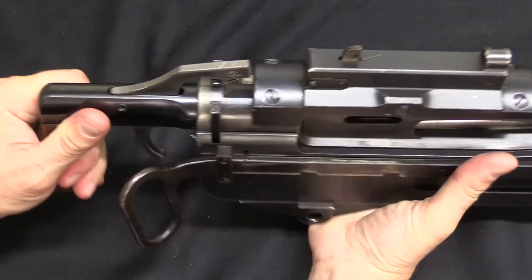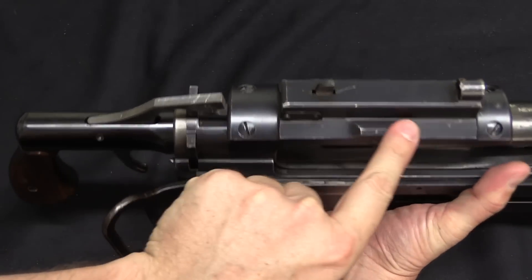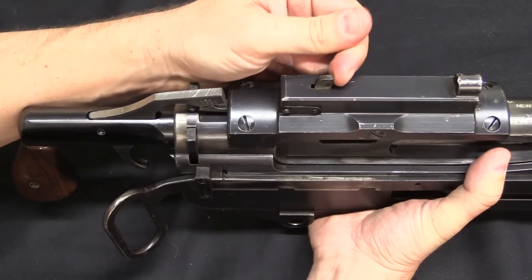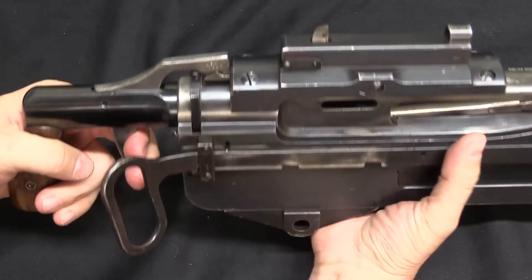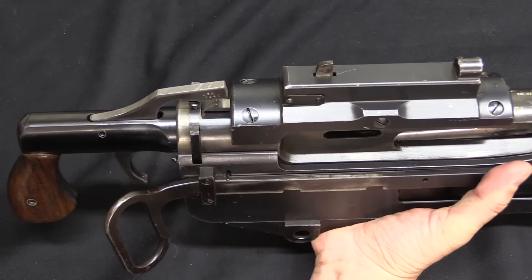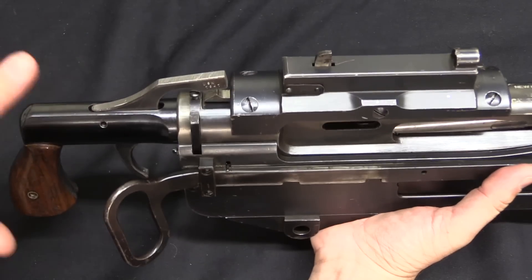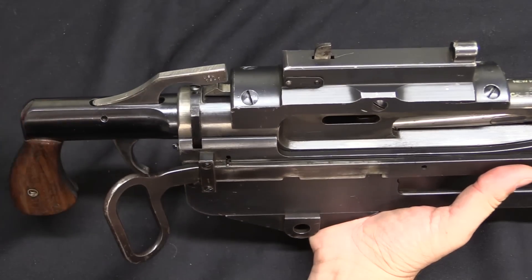This pistol grip has been designed specifically to work with the aircraft gun version, where the trigger is actually built into this assembly — this is the synchronizer mount. You would bolt the assembly coming in from the aircraft engine up here, and this is actually the trigger; you push back on that and it fires. We have an auxiliary trigger here, and the exact reason for this is a bit of a mystery to me. I don't know if some of these guns were mounted as flexible observer guns needing a manual trigger instead of a synchronizer connection, or if there is some other explanation. At the end of this video we'll talk about the further evolution of the gun.